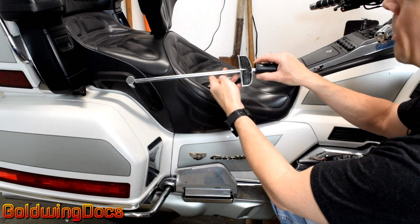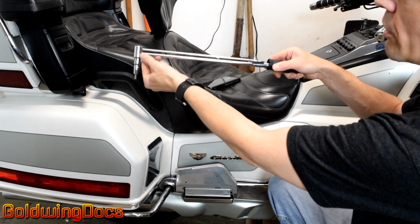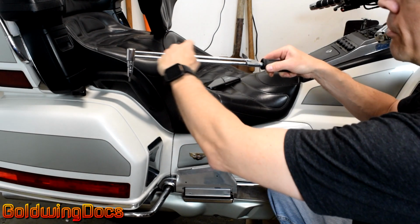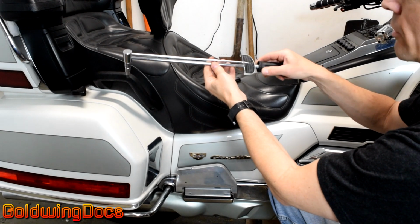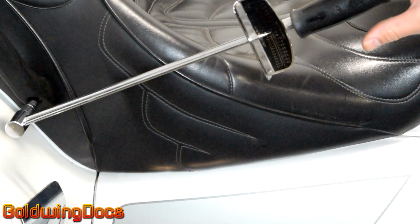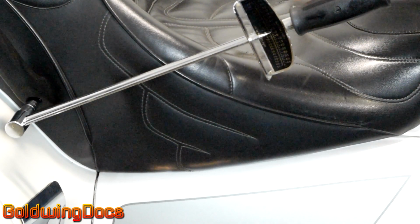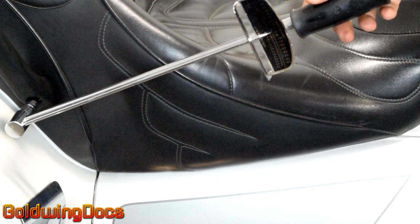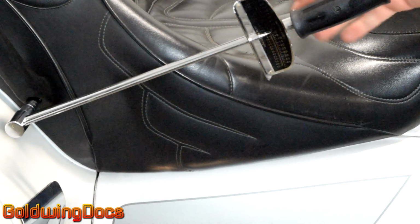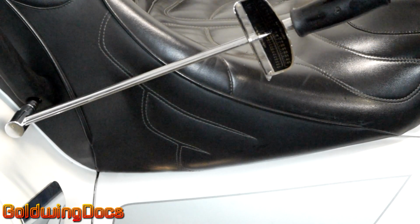Now on this simple beam type wrench, there's a beam here that transmits the torque into the fastener. And the difference between this beam flex and this indicator rod that does not flex shows as deflection on the scale here. It's important when applying torque for the beam type wrench that the handle here is actually kept centered, so you aren't creating more angular force at the end here like this, bending the torque rod inaccurately. So you want to have that right in the center. So basically you're applying force from this spot right here.